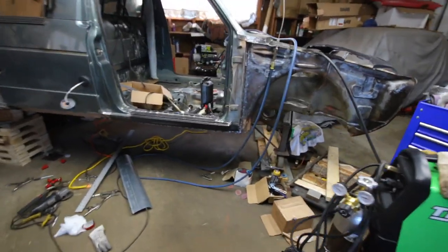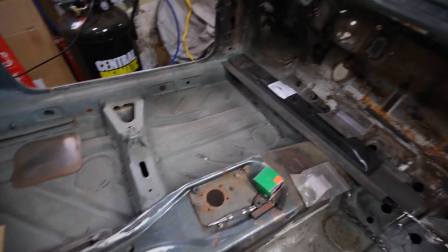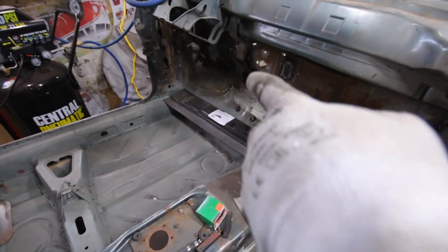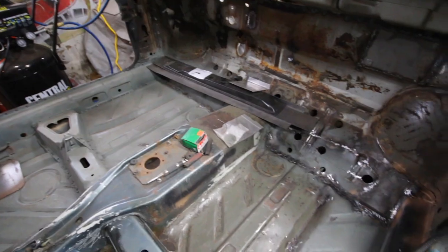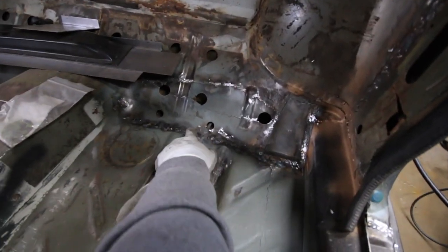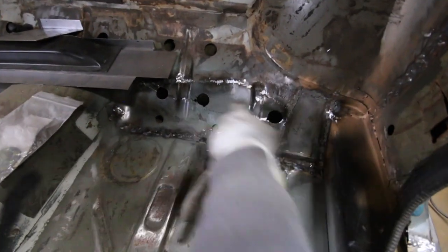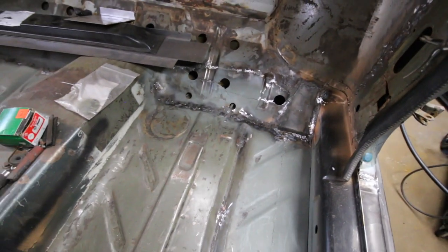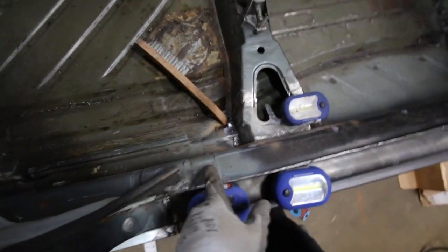Then I got into it — this is where I placed the driver's pan. I've got to fix some areas up there that I didn't really like. This is where I tied in the front clip to the bottom. I had to cut and put in a section there that I cut out when I welded it back, and replaced the inner rocker from about here all the way up and welded it in.